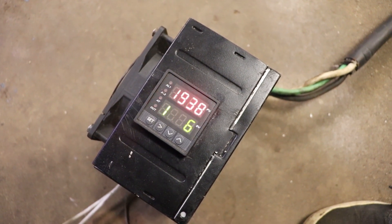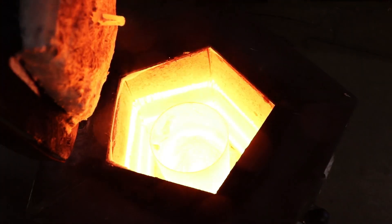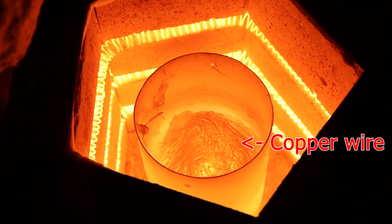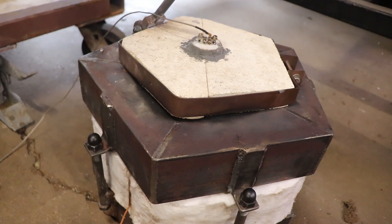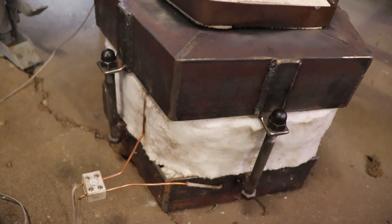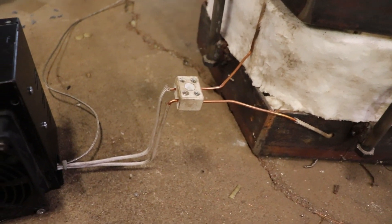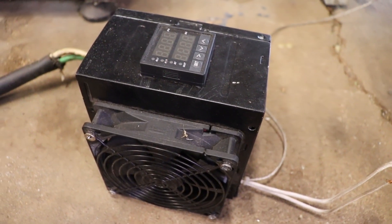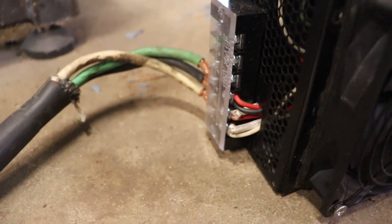In 2020, I began constructing a new furnace with fire bricks, and this is by far the best furnace I have ever made. Theoretically, I should even be able to melt steel in this kiln because the heating elements can withstand a working temperature of 2500 degrees Fahrenheit, but in practice I would say 2000 degrees Fahrenheit is the most you can expect, because above that you risk the elements melting and wearing out much faster. There are other limitations and improvements I will go over, but overall I'm happy with this design.